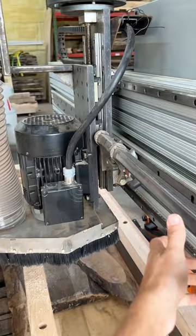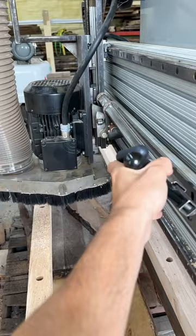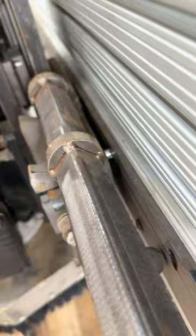The head can be moved across the bed freely, or there are these detents here on this plate so you can step over in five-inch increments, giving you a one-inch step over for every pass. Longitudinally, you can just pull the machine across the bed if you want, or you can engage the power feed.